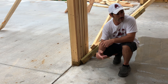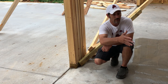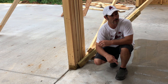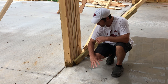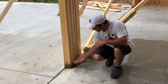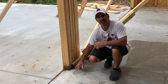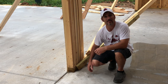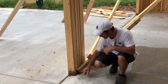When you pull a car into this garage that's wet, or filled with snow in the wintertime, when it melts, all this water is going to be inside the garage. If this concrete is sloped that way, this water is going to come to this wood and it's going to soak it up. And eventually, even though this is treated — everybody thinks treated lumber is magic and it just doesn't rot — it really does, and it doesn't take long.